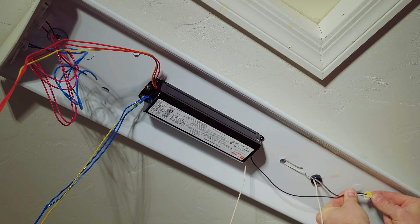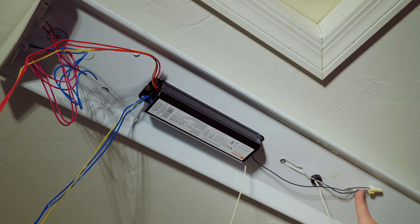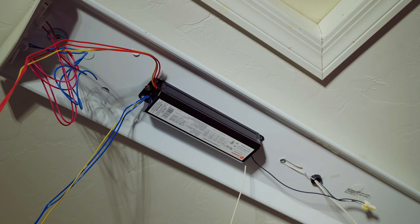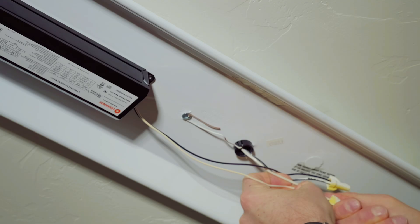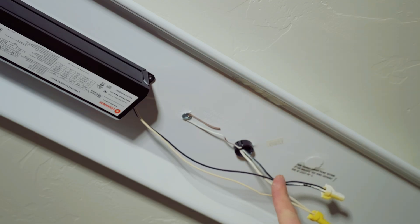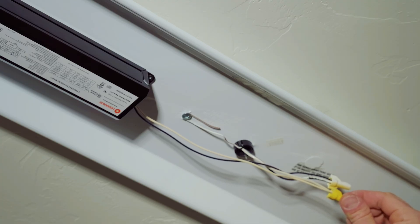I like to give it a good tug on these wire nuts just to make sure they're on there snug. Another option is to put a piece of electrical tape between the wire and the wire nut, which will also securely hold it on. But I recommend before you do that, you pull on each wire to make sure it is securely inside the wire nut before you tape it — because you don't want to rely on the tape to hold the wires together. Then we'll repeat that process with our white neutral, using our existing wire nut. Make sure you twist those wires really good and give them a good snug pull to make sure you have a good connection — very important, especially for these ballasts.